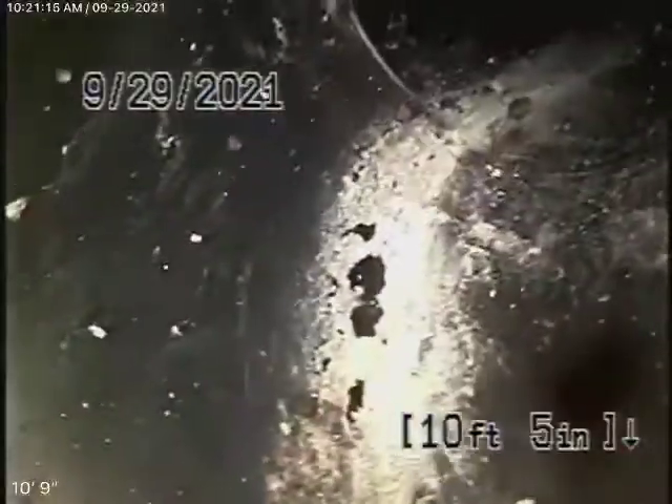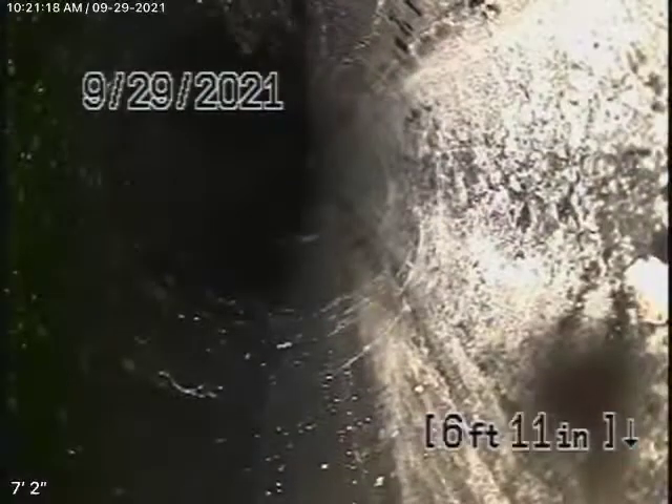Running the camera from this two-inch clean-out here on the side of the house by the air conditioning — it's all ABS plastic over here and this all looks good. We'll have the general inspector check everything under the house. The main line cast-iron underneath the house, in my opinion, looked like it was in pretty fair condition. We'll go ahead and stop the recording here.